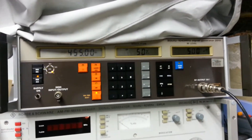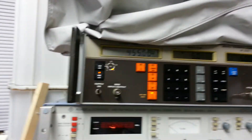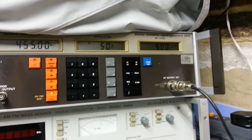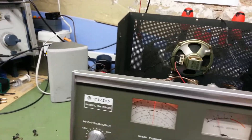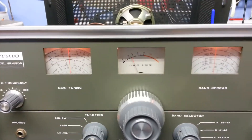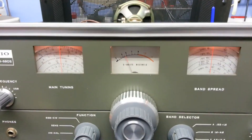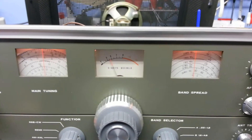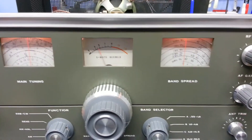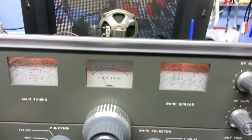The IF frequency is 455kHz. I'm modulating the signal with a 1kHz tone and injecting at 500mV through this loop aerial. As you can see on the signal strength meter, we've got some signal strength showing. The manual tells you to adjust the IF looking at the signal strength meter, which is quite convenient — means I don't have to set up the AC voltmeter on the loudspeaker connections.